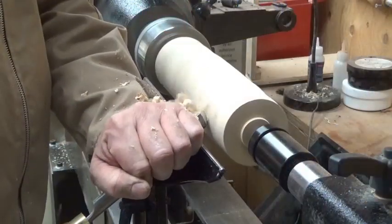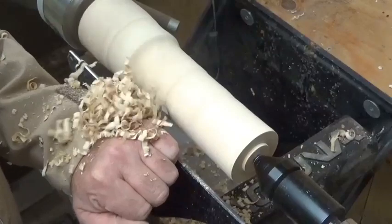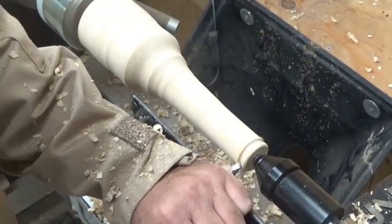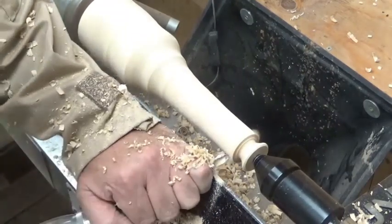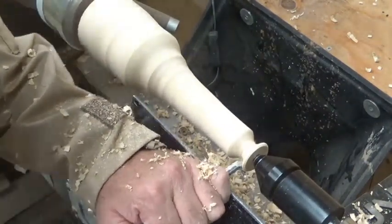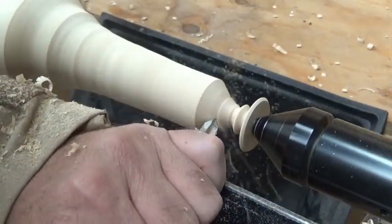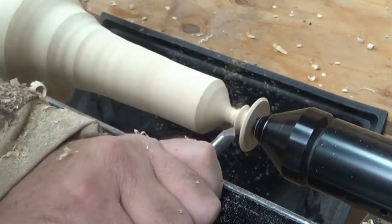Now this is the size of the top piece of the spindle, and I'm removing some excess material with a roughing gouge — makes pretty quick work of it. The direction of cut does matter; it cuts better from right to left on this particular piece of wood. Now with the spindle gouge I'm going to cut downhill with each cut, opening the flute as I approach the bottom of each cut, but initially the flute is closed in the direction of travel — that prevents skidding across the surface and getting catches.